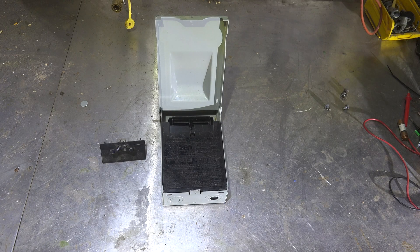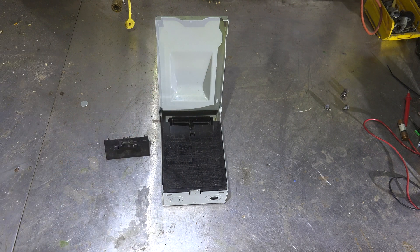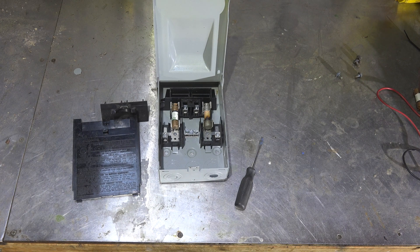In this one I want to talk about disconnects. This is a fusible disconnect, kind of a cheapy thing. It has a plug and fuses underneath. The most common failure on these things is bad connections, sometimes diagnosed as a short somewhere in the system because the fuse blew. Let's take a closer look to determine why this one failed - we've got the cover off.